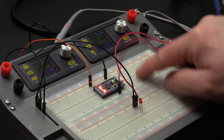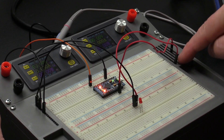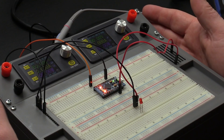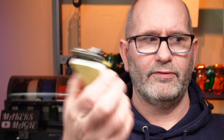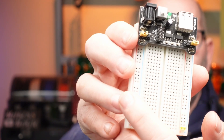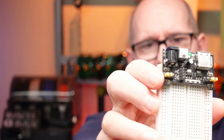For that you will need a few things like breadboards, where you can put your components and connect them together with wire leads. But you also need power supplies — and I say power supplies because you need a lot of them. For simple electronics, like what you see over here, this is a breadboard with two power lines, one here and one over there. This power supply can supply 3.3 and 5 volts directly to this breadboard.